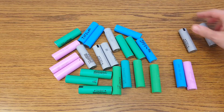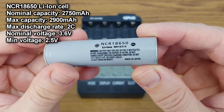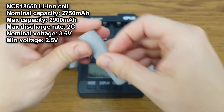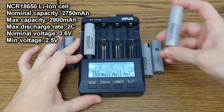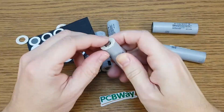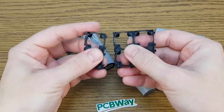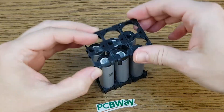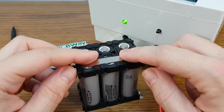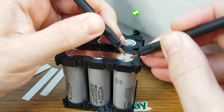I think I also need a battery for this project. I have some old recovered lithium-ion cells — these should be good enough, but I need to test them first. I gave these cells a few charge and discharge cycles at 700mA and they reveal a real capacity of 2.5 amp-hours. The insulation rings are damaged, so I will replace them with new ones. I need some plastic holders to make a battery pack with 6 cells — this is a 1S6P battery pack, so the cells will be connected in parallel using 0.12×8mm nickel strips and my DIY spot welder.